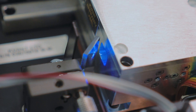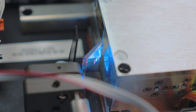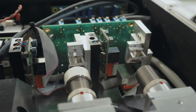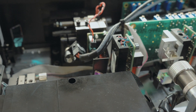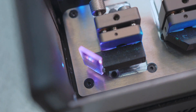As we move on, you might also notice some small optics inside here. These are either optical grade mirrors or dichroic mirrors. They may allow you to combine colors — so in those larger projectors where you have a separate red, green, and blue, you'll often have a few different dichroic mirrors which allow you to combine that beam into the scanners, which we'll talk about next.